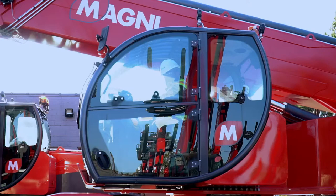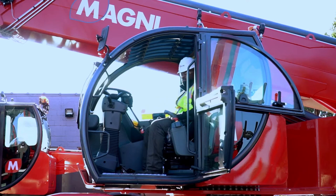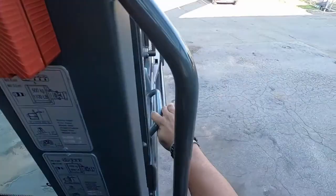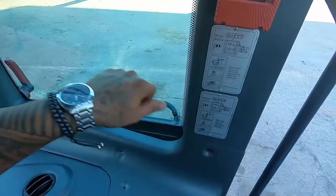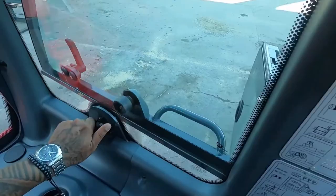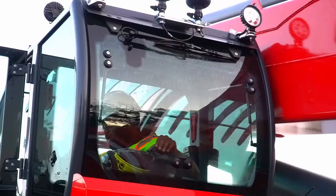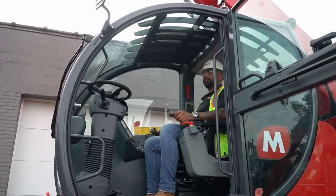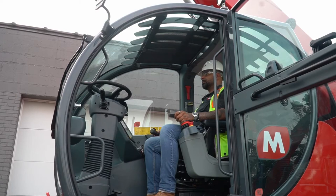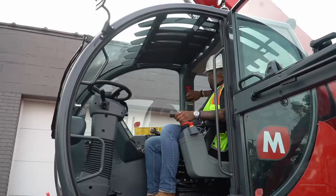Now we'll review door and window operation from inside the cab. To open the door from the inside, pull the lever and hold the door as it opens to ensure it does not fly open in windy conditions. The cab door is equipped with a window for natural ventilation — turn the lever counterclockwise to unlock and push the window out, guiding it all the way until it locks in place. To release and shut the window, turn the spring-loaded lever clockwise and guide the window closed. The rear window can also be partially opened — turn the handle clockwise and push it out; to close, pull back in and lock. In an emergency where you cannot open the door, it may be necessary to break a piece of glass. A red hammer is located on the right side of the cab — use it at the corners, which are the weakest points of the glass.